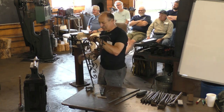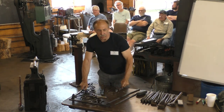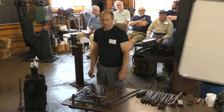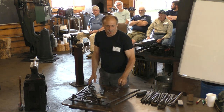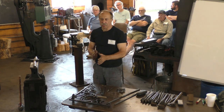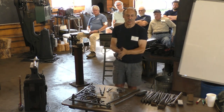But it's a whole different decision making when you have a helper. Could be riveted on too. That takes longer than forging it out. You've got to punch 2 holes and make sure they line up. If you don't have a drill press, it changes everything also.